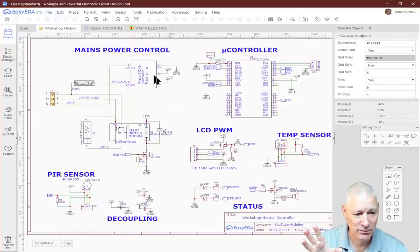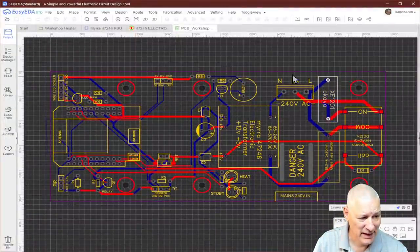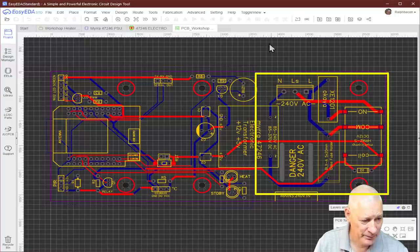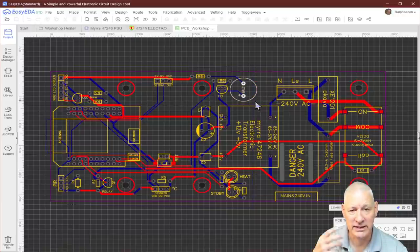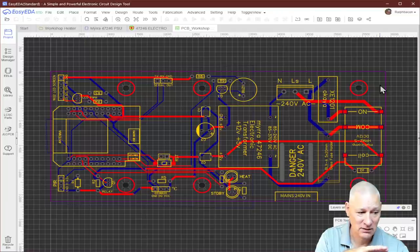I had to create a footprint for the transformer, so going into Library, I can look up the footprint in my workspace. There it is — it looks pretty much like it does in real life. The pads are numbered: number one through to number five, exactly as per the manufacturer's diagram and my schematic. Now you have something physical to implement and can put it on a PCB to see how it looks. It was a very iterative process — this did not come easily. I'm still doing it even as I'm recording this, having almost reached the end of the circuit diagram and PCB design.